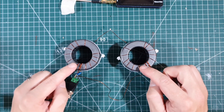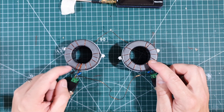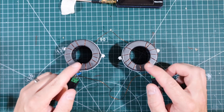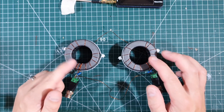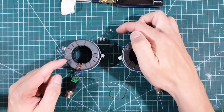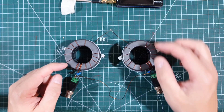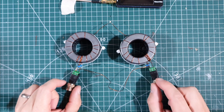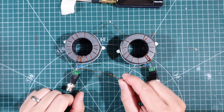These transformers are actually stacks of three — FT240-52 cores, made popular by Steve Ellington for running high power. I've got thinner wire on these, but in my experience checking back-to-back insertion loss with this method, the wire diameter doesn't really matter. I'm not putting any real power through it. These ends are actually soldered together — this is the antenna connection. On the other end I've got little BNC connector blocks, with the hot side on the plus and ground to the negative on both, plus a little ground wire.